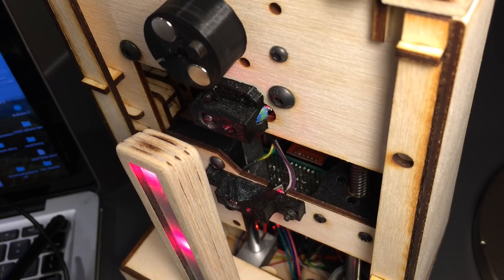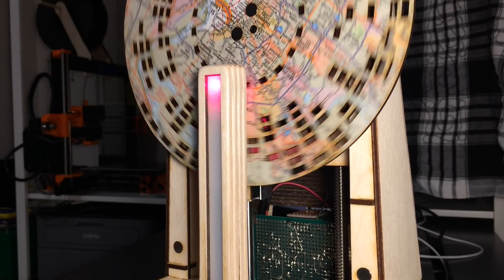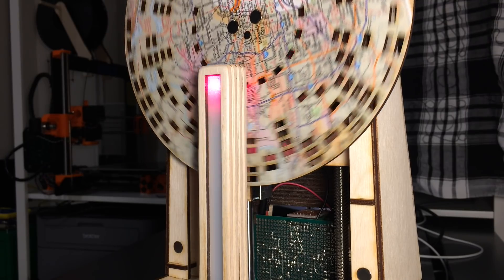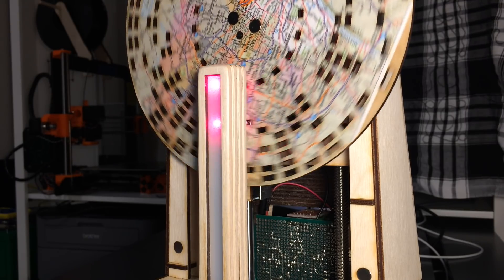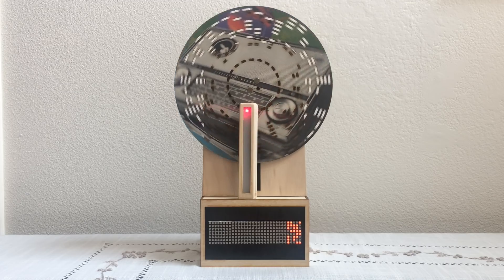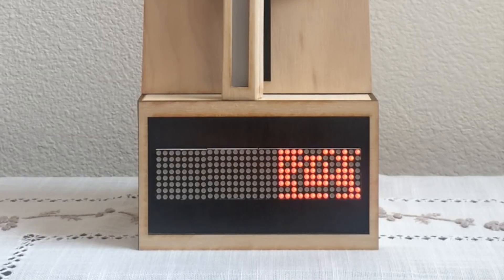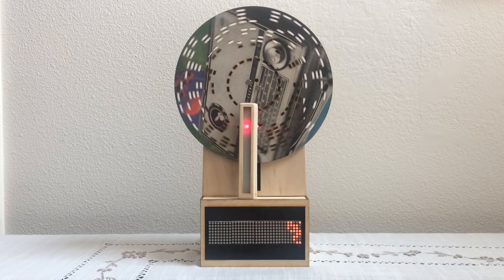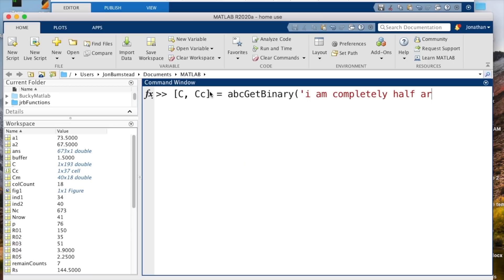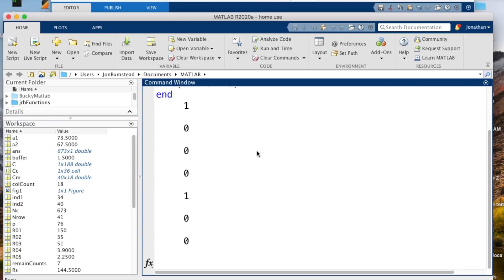To shift to the next row, the detector moves on a stage mounted to a linear actuator. To block the laser beams passing through the disc, I have a piece of acrylic that diffuses the light and provides a way to visualize the zeros and ones being read off the disc. Reimagining the data stream off the disc was an important part of the project. As the data is being read off the disc, the LED matrix in the front is populated to visualize the binary information. The device also plays a MIDI note when a one is read. The music produced may sound random, but it symbolizes a series of ones and zeros that actually hold meaningful information describing the text message.